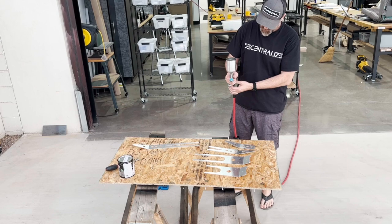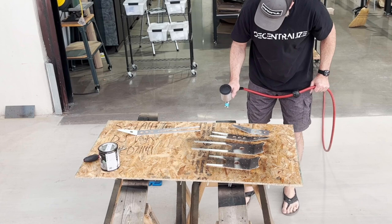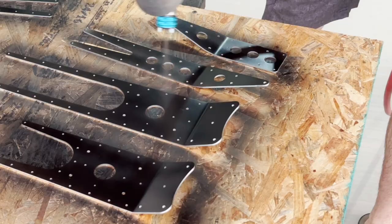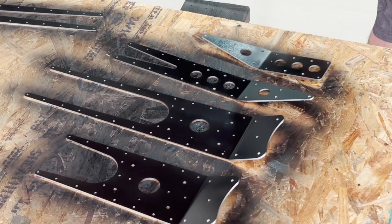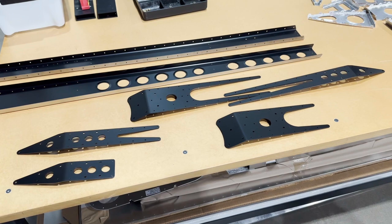I'm gonna prime the spars and the spar doublers. Wherever there are material that's getting riveted together, I'm gonna go ahead and prime those surfaces using the single part black SEM primer. Spars and doublers are primed, and I'm ready to move on to clecoing this thing together.